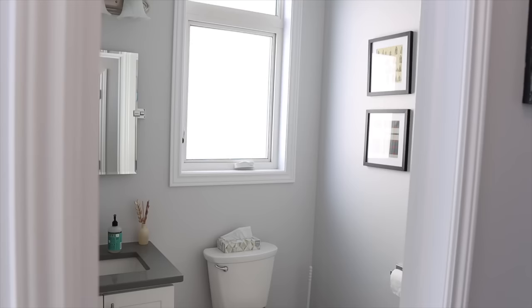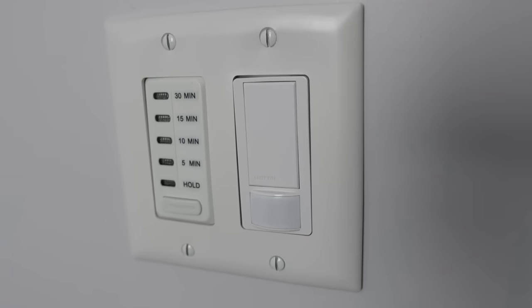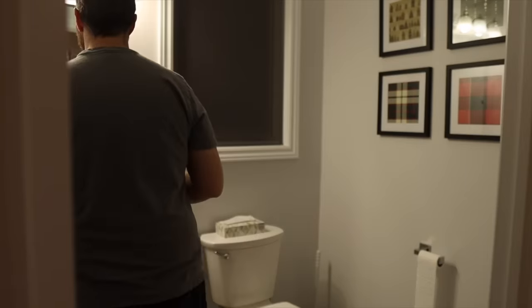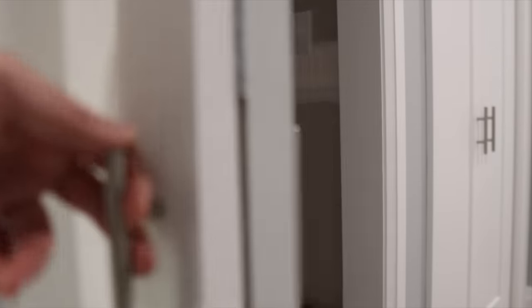I think smart devices don't always make sense. One example for me is my powder room — it's about the only room where I don't have any smart switches. Instead, I'm using a Lutron light switch with a built-in motion sensor and an ambient light sensor. When someone enters the room and it's dark, the light turns on, and when they leave, it turns off a minute later. It's so simple — everything is programmed right within the device, no HomeKit codes, no scenes to worry about. Adding a smart switch in this particular room would only complicate things. This kind of switch can also work well in closets, so it's a great way to keep things simple and save a little money.